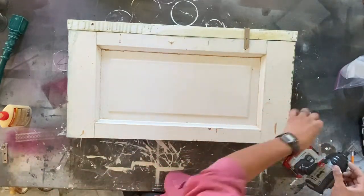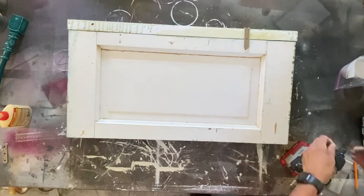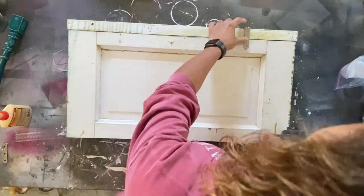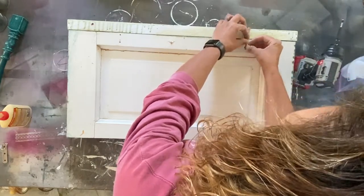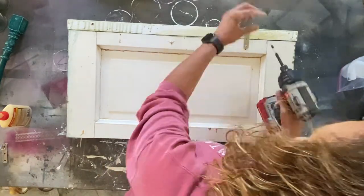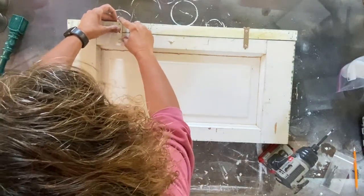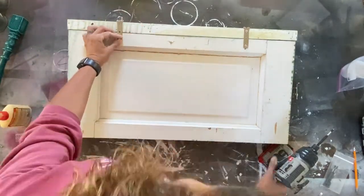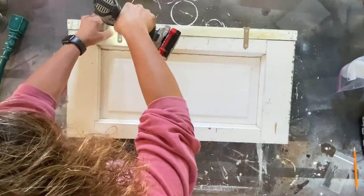My hangers come from Amazon — they're three-hole hangers. I have two-hole hangers as well, but for heavier projects I use the three-hole ones. I only use two of the three holes though, because the second hole lands right on the seam between the shelf and the back piece, so a screw there would be useless. I go ahead and put two screws in each hanger and it hangs up no problem.